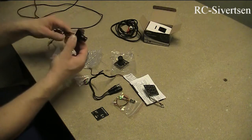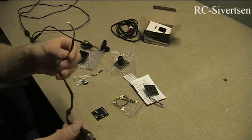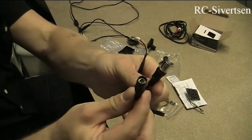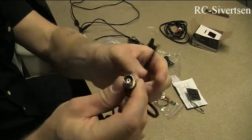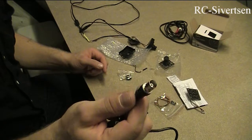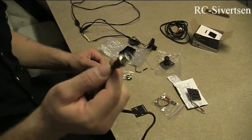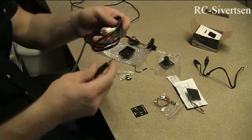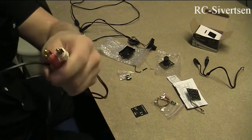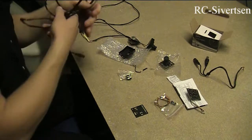I have one already set up here because I bought two of them. Along with the camera there is this power lead with a power input and then the video output — I think this is a BNC connector if I'm not mistaken. However, I didn't have this kind of monitor to connect to it or any leads to connect to it, so what I did was I just cut that one off. I took one of these cables with the white and red — the video and audio — with this jack here, so I slaughtered that cable and made myself a new one.